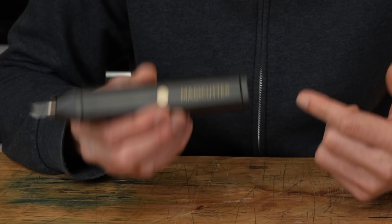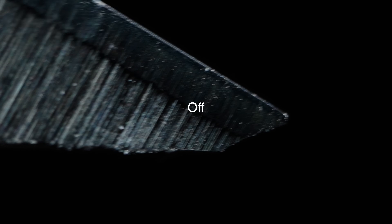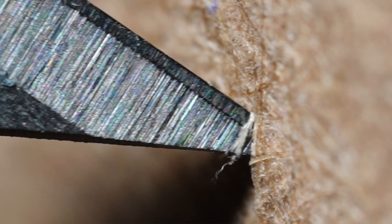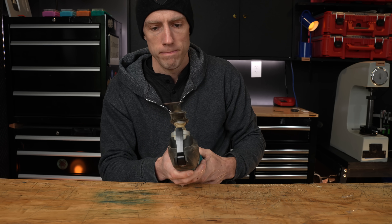So what is an ultrasonic knife? It's a knife blade attached to a small piezoelectric element that vibrates the blade usually only a handful of microns, on the order of 20,000-plus times per second — or 20,000-plus hertz. These oscillating multi-tools use a much slower blade oscillation speed of around 20,000 oscillations per minute versus 20,000-plus oscillations per second of the ultrasonic cutters to saw through material.